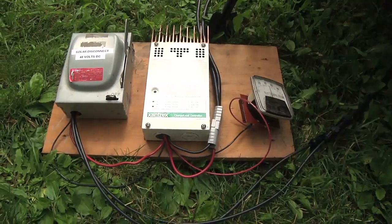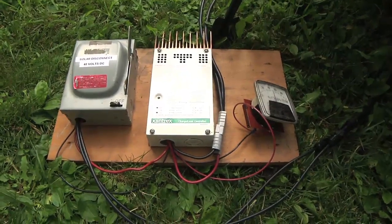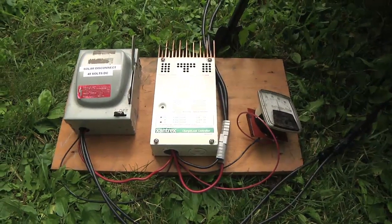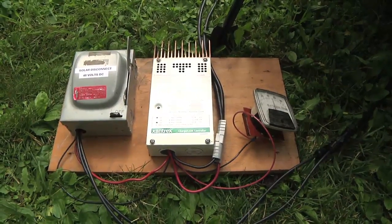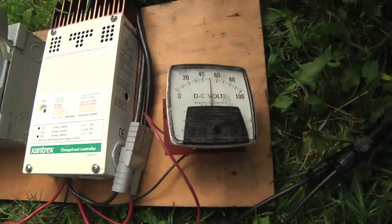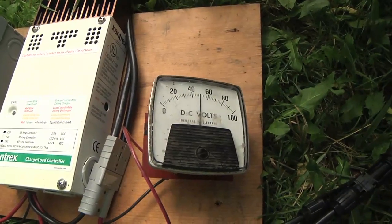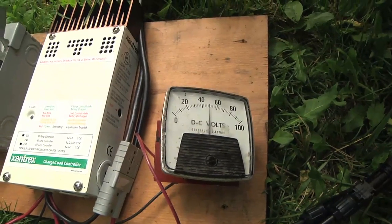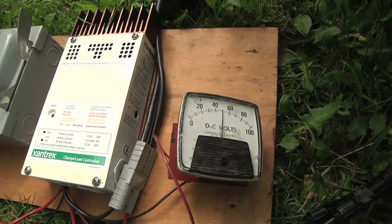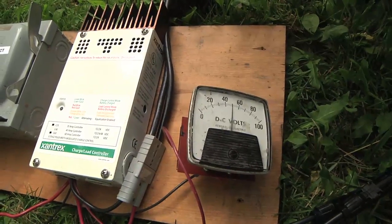This is just doing a little bit of testing — none of this equipment is designed to be outdoors or sitting on the grass. It will all need to be permanently mounted in my garage, out of the weather, with conduit covering all those connections. I'd also like to add an ammeter — a zero to 10-amp ammeter — because the voltmeter tells me what voltage is available to charge, but it doesn't tell me how fast it's charging.